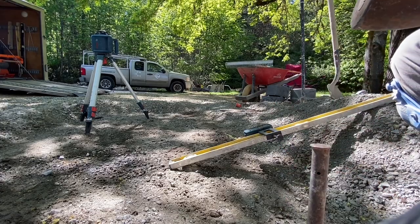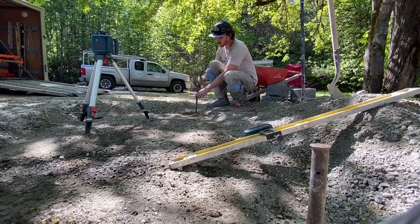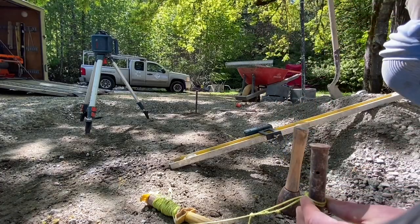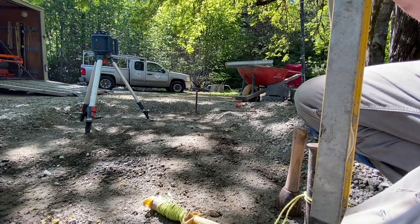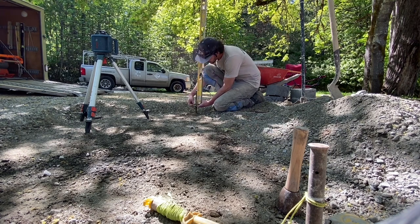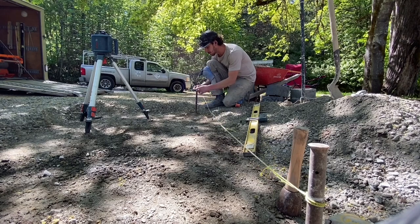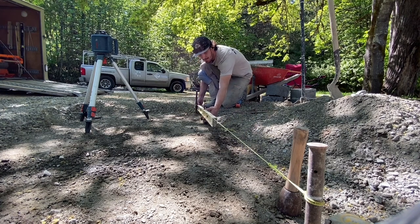The simplest way to do things is the best — it saves us the most overthinking. I always like to set up my stakes where I need them for the perimeter of a patio or wall, whatever you're building, and establish our benchmark first. That can be, say, two inches underneath the siding on the house or the threshold of a door — whatever you need to match up to is your benchmark. Simply use the laser, set the bottom of your stick to that height, and transfer that benchmark height onto all of your other stakes. Then calculate your slopes after. Or if you're setting up for an actual level line, you can simply attach that line and double check that it is indeed level — and you're ready to go.